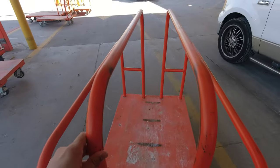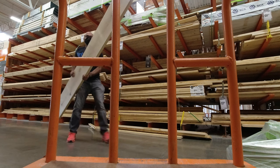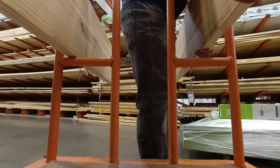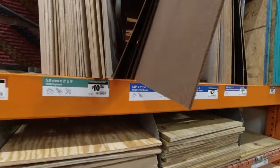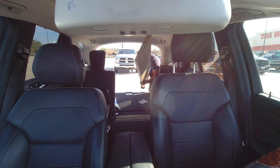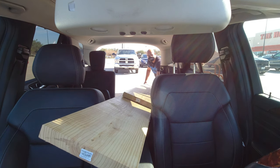The project started with a visit to my local hardware store to get all the materials I need. In terms of lumber, all I need are two 2x12 boards each eight feet in length and one 2x4. I had a spare 2x4 at home, so I just needed to get the 2x12s. Ideally I would have liked to use 1x12s instead, but 1x boards are significantly more expensive than 2x boards and I wanted to keep the cost to a minimum. I also picked up a 1/8 inch tempered hardboard to use as the backing material. The total cost of my Home Depot trip was roughly $40, since I already had screws, glue, and other consumables at home. You do need basic power tools like a drill and a circular saw, but I'm not factoring those costs into the numbers.